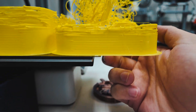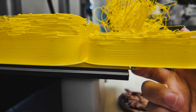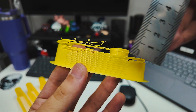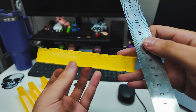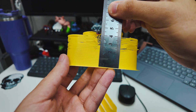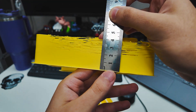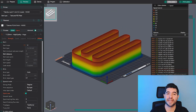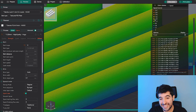When you start to see holes and small failures, it's because there's not enough PLA being extruded to deposit on top of the previous layer. Measuring where it stopped working: at 220°C, failures started at around 15–16mm. Looking at the slicer, that corresponds to around 139–166mm/s — transitioning between those two speeds. In different types of files you may not see those fails because the printer changes direction so often it can't sustain those speeds long enough.